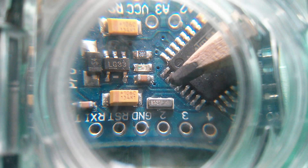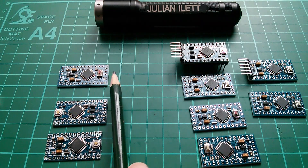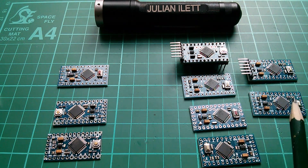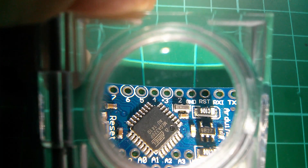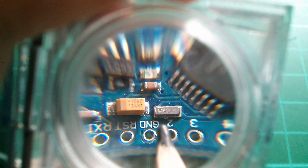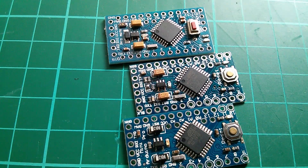We can clearly see LG33 on the regulator. Are all 8 MHz ceramic resonators marked with an 8 or something like that? I appear to have three 3.3V Arduino Pro Minis and six 5V ones. Checking these three: this one says 80M, this one says 80Q, and this is the one that says 80S. So certainly the 3.3V Pro Minis all have an 8 somewhere on the ceramic resonator.